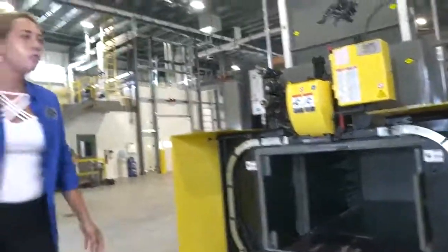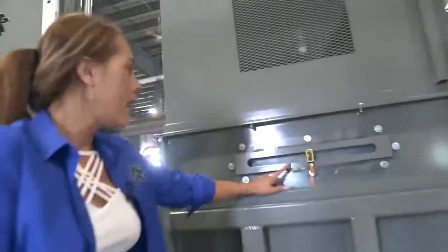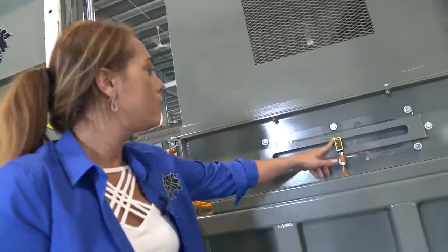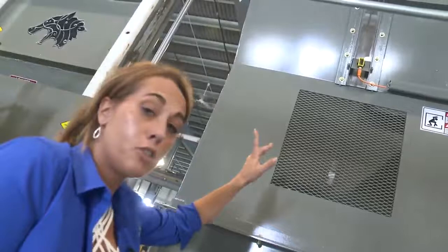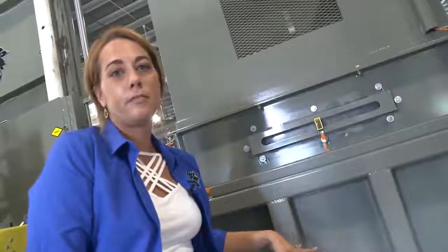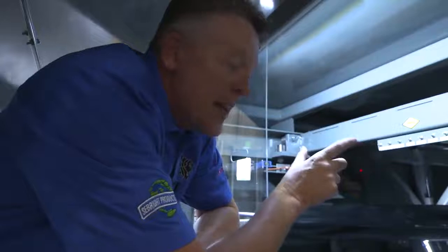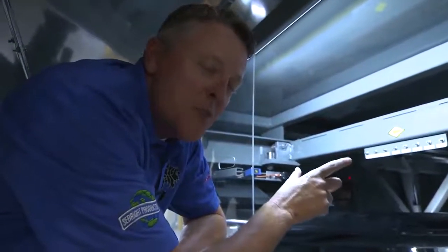The adjustable eyes: the lower eye really helps eliminate shear jams — it's movable so you can make sure you don't jam. The upper eye allows you to make adjustments as you're changing material to ensure you get a full charge. We're using twin 7-inch cylinders on the backside, and our angle of attack actually allows us to achieve higher bale weights using less pressure.